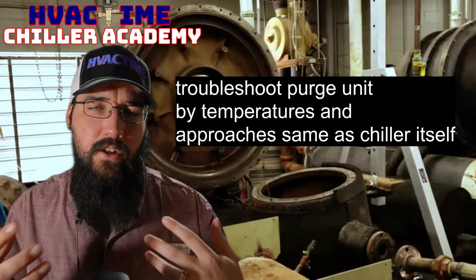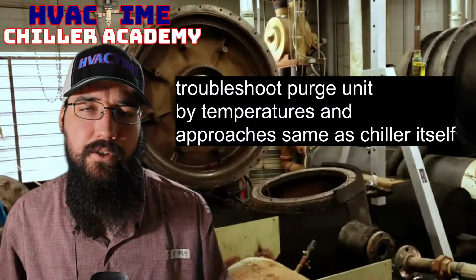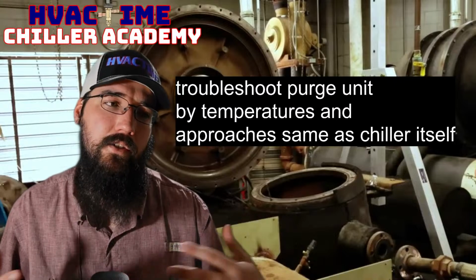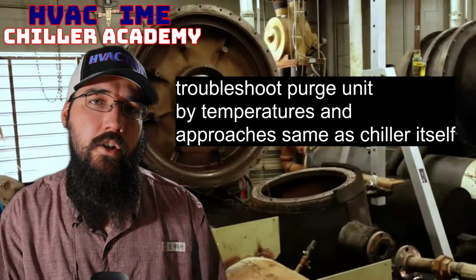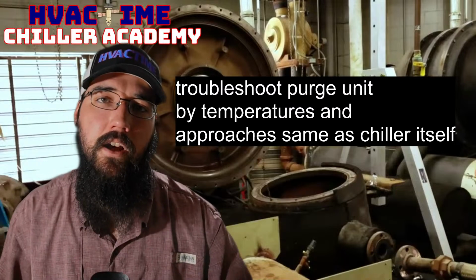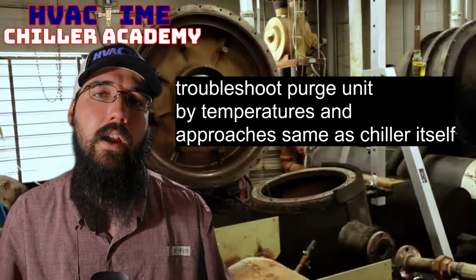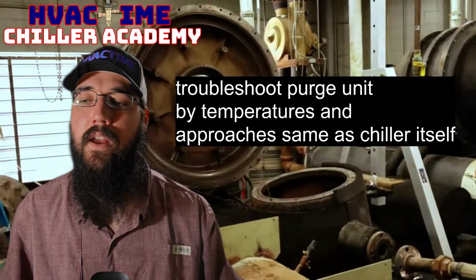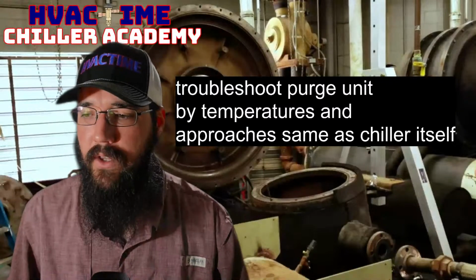Yeah, in my opinion, you don't troubleshoot those the same way you would a regular little refrigeration unit or system. Granted, if you're used to working with small appliances, like that's something I did early on, you didn't hook up to those either. You took your temperatures, you looked at a lot of different variables without actually tampering with the refrigerant circuit itself. And that was always the worst case, last thing you did scenario. But the approach values and stuff just don't quite line up the same for those.